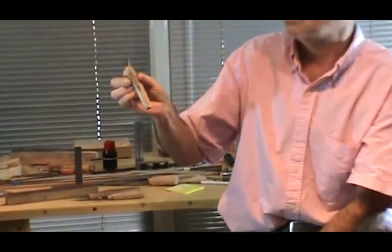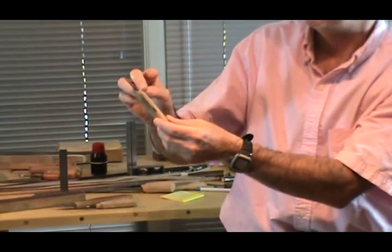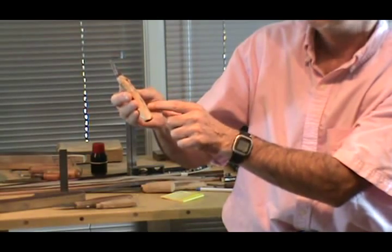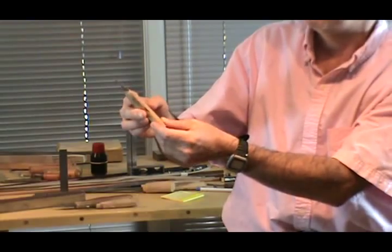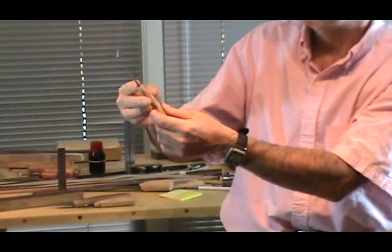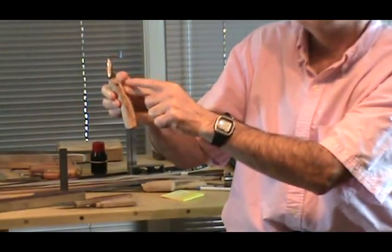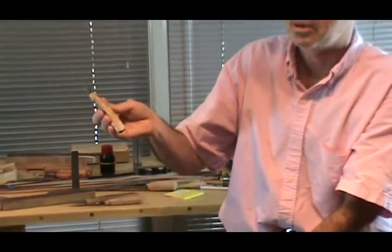When you start making this knife, it's very simple. It's just made from pieces of maple — a half-inch piece. One part of the knife is cut out and there's a recess created, about five-eighths to three-quarters of an inch inside the piece of wood, with about an eighth-inch recess or dado. The knife is glued together with the blade inside, and then I put on a threaded Allen screw to tighten and lock down the knife against the back of the wood. It's a very simple operation easily done at home.